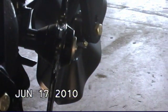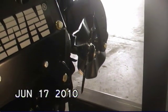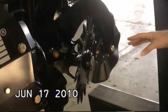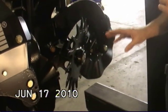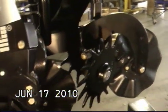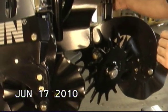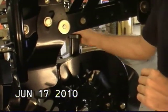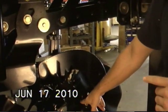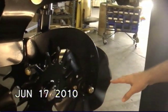The scraper has proven to be more of a hindrance than a benefit in many instances. The hubs on the blades have larger diameter bearings — inch and a quarter inner Timken tapered roller bearings. The row cleaners and the gauge wheels have one inch tapered roller bearings. The row cleaner wheels are screw adjustable and are mounted straddling the rear edge of the coulter blade in the patented Dawn coulter combination arrangement.